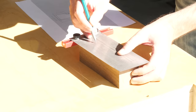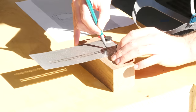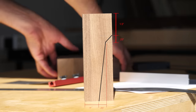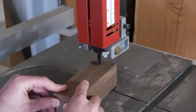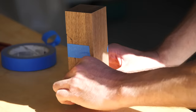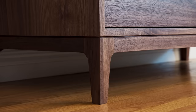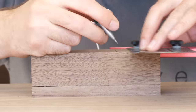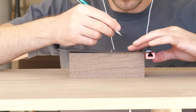I'm trying a new style of leg that I've never made before. I'm not sure if you'd consider this a cabriol-style leg, because I don't know if that refers to the aesthetic or the technique used to cut it — but either way, this is basically just a super minimalist version of that. Once I had all of my angles marked up on the piece, I headed over to the bandsaw and cut them out. Then I took the offcut, taped it back on, rotated the whole thing a quarter turn, made the same marks, and cut it out again. That leaves you with a piece with tapers on the two inside faces. Once I was sure it had worked out, I did the same thing to the other three legs.